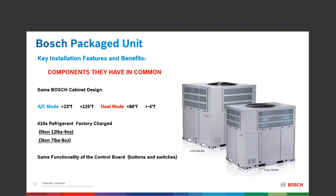On the R-410A refrigerant, these units are factory charged. We would never want you to put your gauges on this unit just for a maintenance scenario. Basically: sit on a bucket, push a button, take the numbers down, and react accordingly. The 5-ton unit comes with 12 pounds and 9 ounces factory charge; the 3-ton comes with 7 pounds and 8 ounces factory charge.